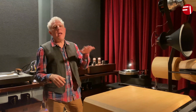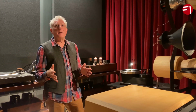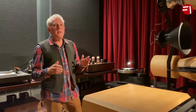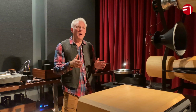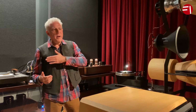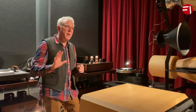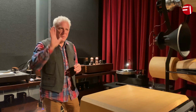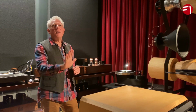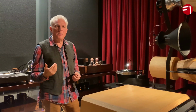The other thing, though, which isn't in the amplitude domain, which I'd like to just mention, and that's something that we're concentrated on, and I never hear it discussed in the high end, not in the magazines, not in talks, is the time domain. And that is the accuracy of a speaker and of the audio system in time. So if you have inefficient loudspeakers where transducers or woofers, for example, are moving a great deal to provide the SPL required, they will never be able to stop on a dime, as we say in English. You know, there's overshoot, and you have smearing in time of the music. And this is really very negative to properly be able to hear music.